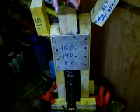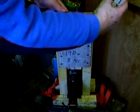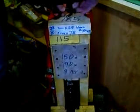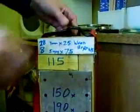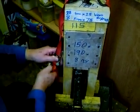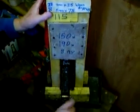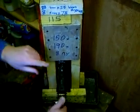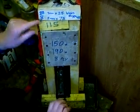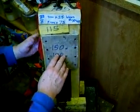The piston is a rattling good fit inside the uprights. The top piece is closed down and they're restrained with a ratchet strap. When the jack puts some load onto the piston and up through the brick, you'll see it presses the wood up and it deflects quite a bit. That's where the ratchet strap is holding it back. There is pressure on the brick all the time and it will help to dry it.